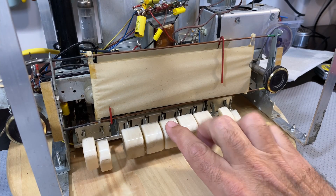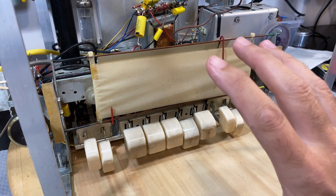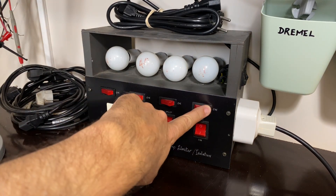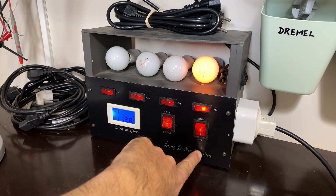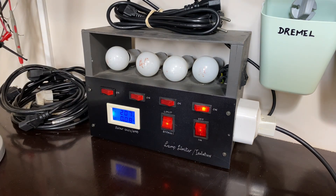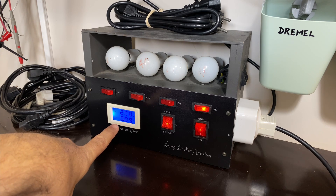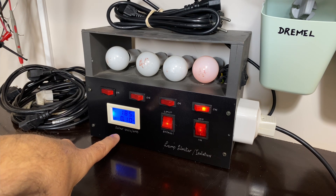I'm going to select medium wave. So this is already on. When I switch on the dim bulb limiter, it'll have power. We've got one 40-watt bulb in; the others are all off. Limit's on - I'm going to hit it. The light bulb went slightly bright - that's the 40-watt bulb, so very little current is flowing through there. 80 milliamps - the voltage is dropping because the current's increasing as the tubes start to conduct. Let's put the volume up. I can hear a buzz.